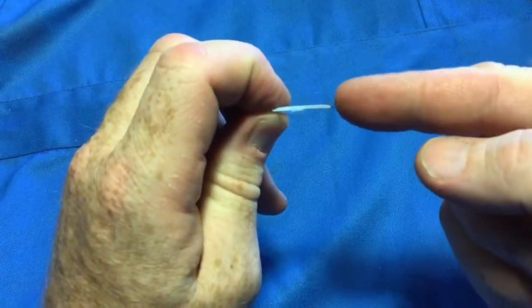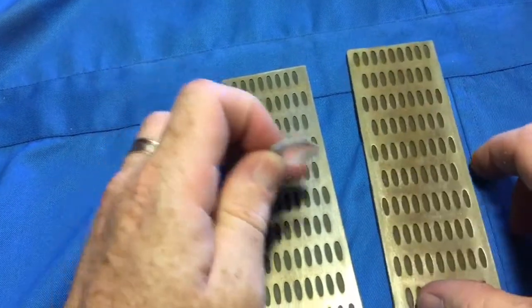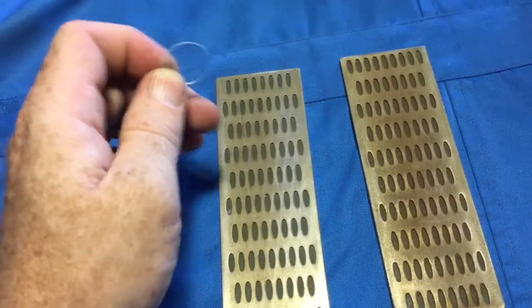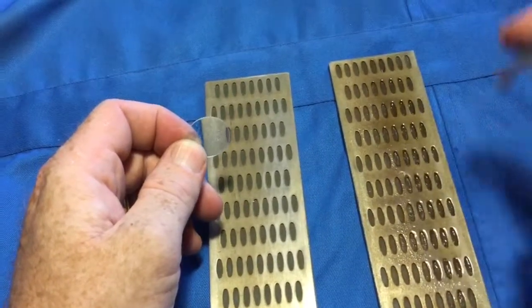The edge is too square, so I'm going to use a diamond hone to put a bevel on it. I've got an extra fine and a fine hone, and the fine one proved to be sufficient. If you don't have diamond hones, 800 grit wet and dry paper will do fine. Glass dust isn't good to breathe in, so keep the grinding surface wet.